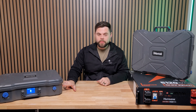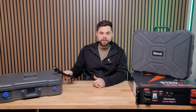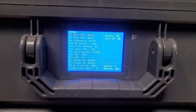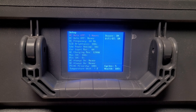When you go into settings, you can change almost every aspect about this. In order to change the dark start features, you do have to go into the programming of this unit, and doing that is a little tricky. First, power down the X1200. Then take the wall charging cable — this is just a normal C13 cable that came with the unit — plug it into the side. It will turn itself on, and then you press and hold the AC output button for approximately eight seconds. A programming screen will show up on the little screen, and to adjust each line item you click the AC output button; to go down the list to a different line item, you hold the AC output button. It's very programmable and customizable.